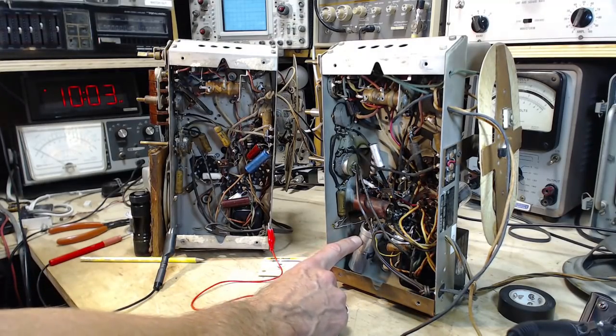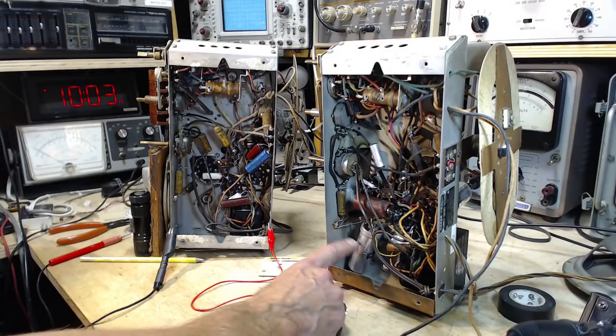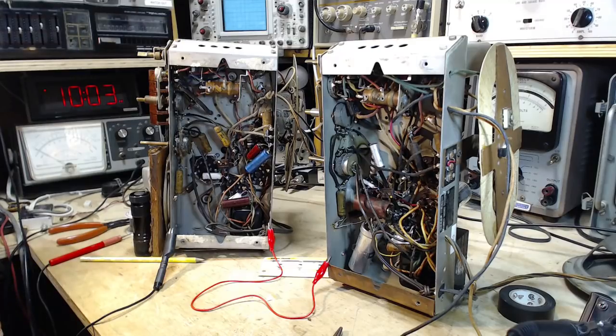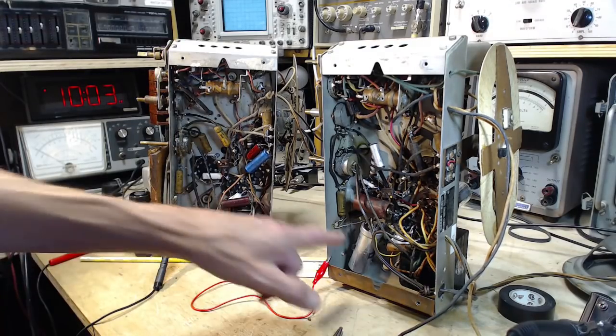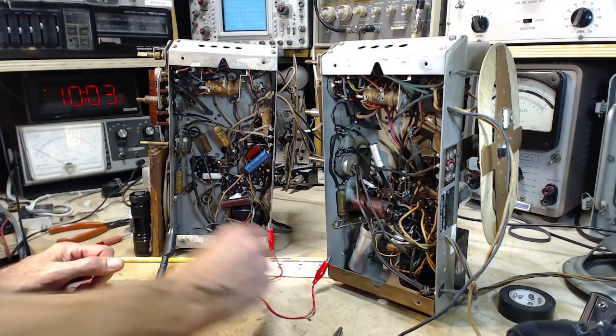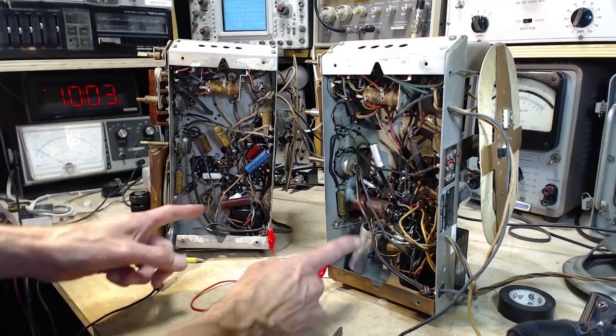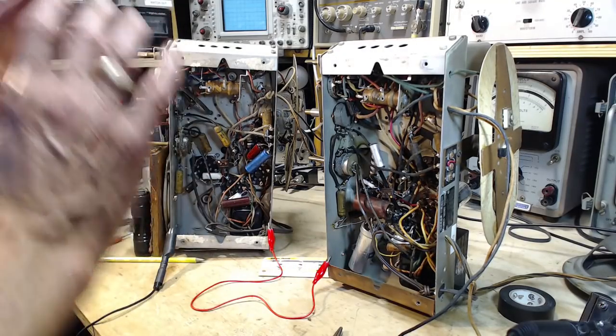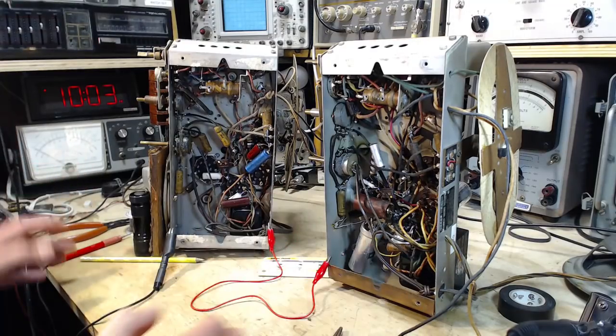These kind, in my own experience, when they're in these metal cans here, they're actually pretty good. And if the radio involves a field coil, often it seems as if the capacitance here isn't as critical in eliminating power supply hum and stuff like that. So when I see one of these, I don't jump right in and change it, especially if the radio exhibits no hum.